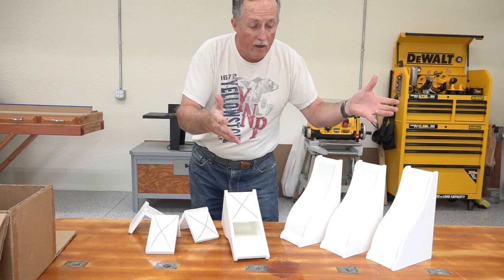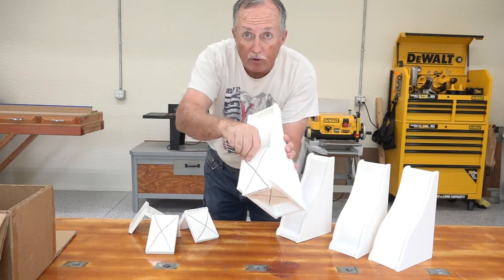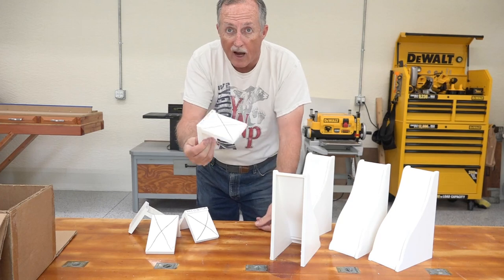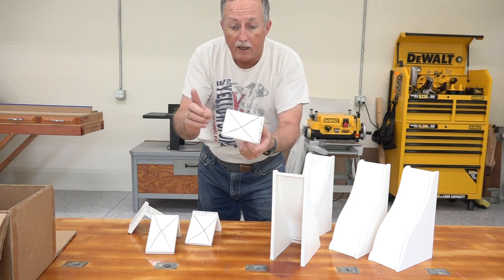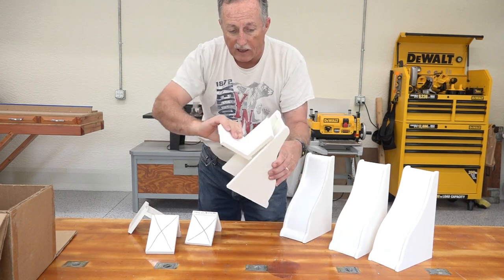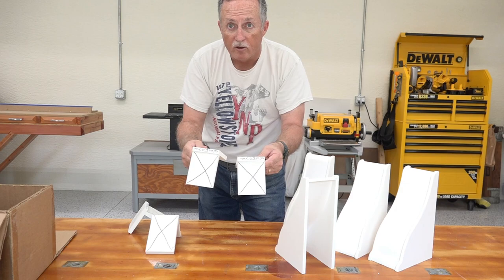As you saw, these brackets I've now cut all had a spacer in the back. This was just for shipping, I guess, to make sure it keeps its shape. But now, these blocks that say 'remove' — which you'd normally just throw away — I'm going to use them and attach them to the vertical surface and underneath the counter, and that will be what actually engages and holds the corbel on. So we have to take these pieces, break them apart, and notch them. Let's do that next.